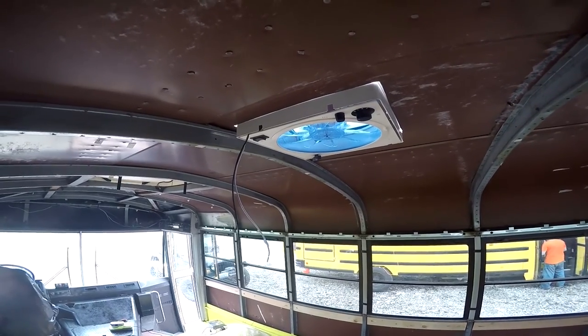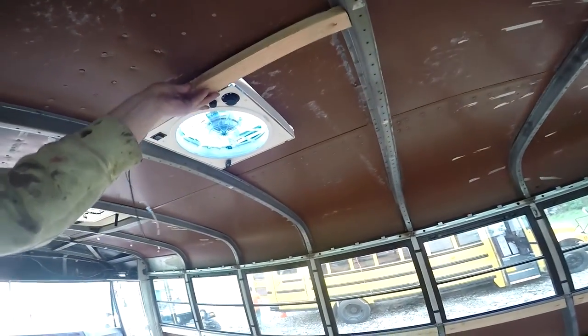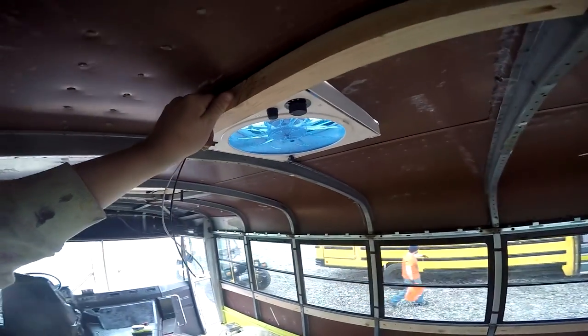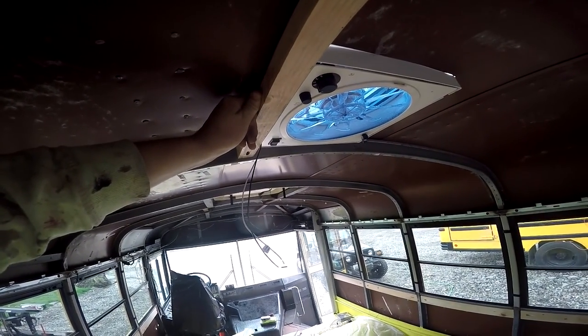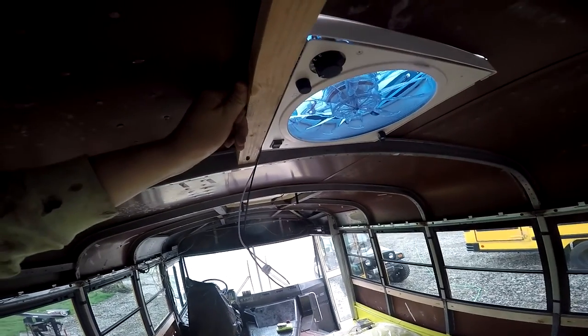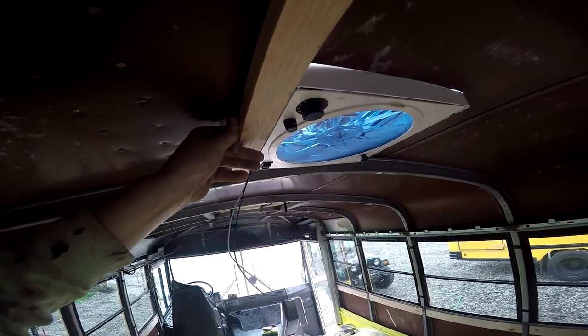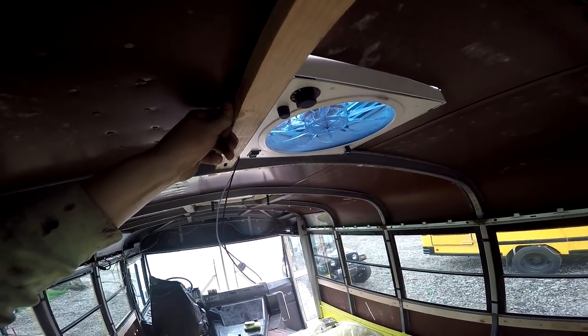Here's what we've got so far. It fits in pretty well. And then I'm doing the same thing I used for the wall studs — it's going up right here like that, and then I have another one that's going to go on the other side. I know I'm moving around a lot here, I do apologize, but it's kind of difficult to show you what I'm trying to do. So I've got those up like that, and then I'll be able to screw into them from the top. I have both supports on there, and it should be pretty solid, no issues.